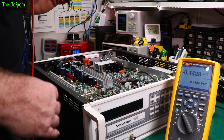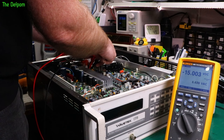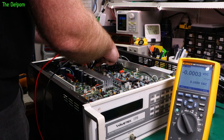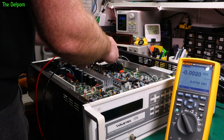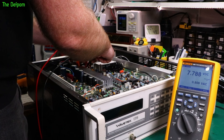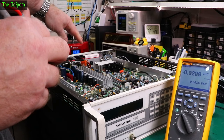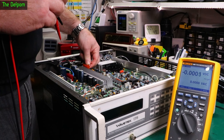Now I've unplugged that connector — let's see if everything has changed. There's an earth pin there, and 15 volts. Minus 15 volts is there. Plus 15 — yep, that's still there. We've got 5 here — yep there's 5. So those are working now. That's 25 volts getting 7.7 now — and the 44 volt line is showing 47. So we've got voltages on that socket now. So was it me reseating the connector that changed something, or me unplugging this other connector? Let's plug that back in again and turn it back on.